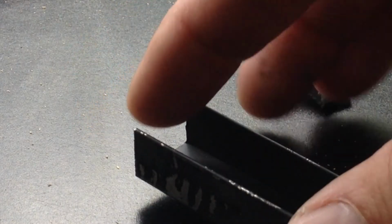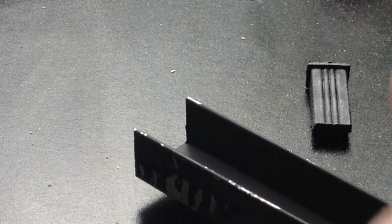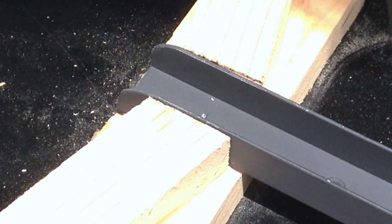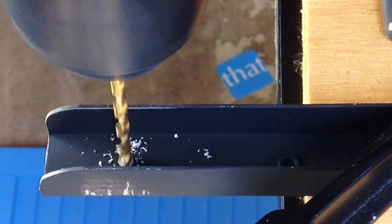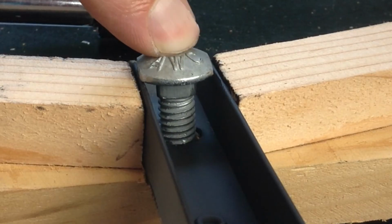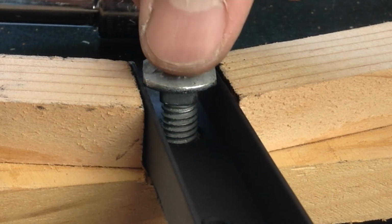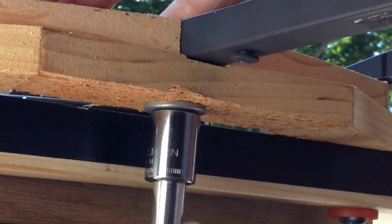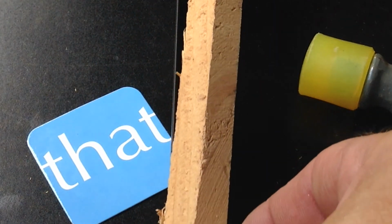The ends of the aluminum needed a bit of shaping. I decided to round over the sharp edges on the aluminum posts by running it over a belt sander. I touched it up with a coat of paint after rounding the edges, marked the hole position, and drilled a starter hole which would be expanded later to fit the size of the bolt. The galvanized bolt needed a bit of shaping to fit into the aluminum channel, so I used the belt sander to shape the head and remove the material. A washer and nut attached to the bolt, securing the post to the spider frame.